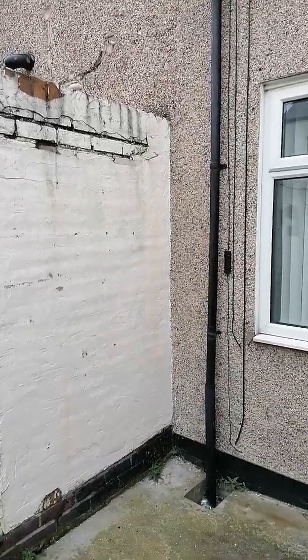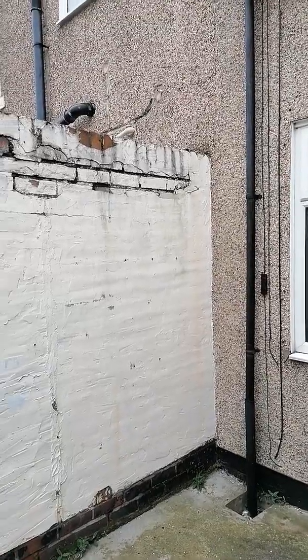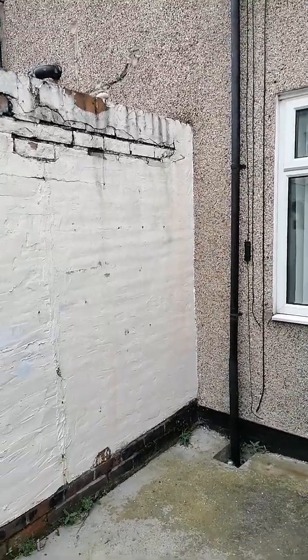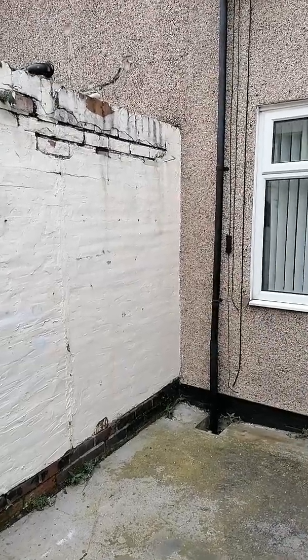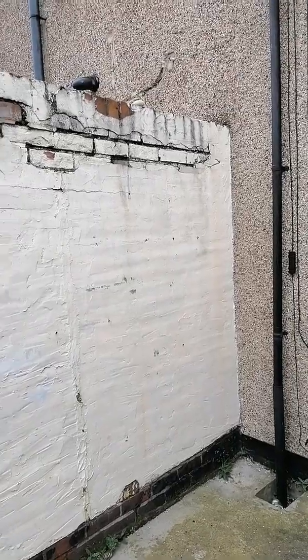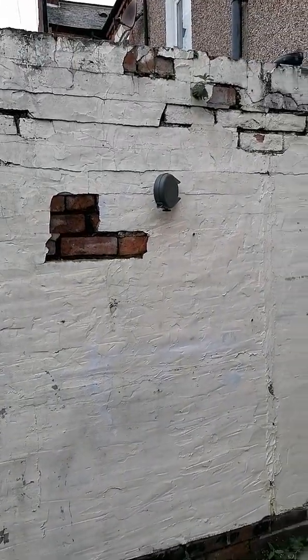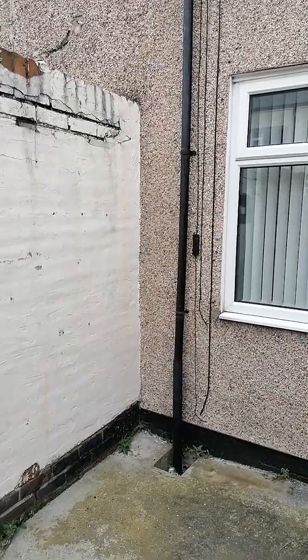Just a little tip: if you come across these distinct elevated readings — a lot higher than you'd expect — take a look outside. If you've got an abutting yard wall, it's almost certainly going to be a contributing factor, especially when it's rendered as in this instance. You can see the render isn't very good. I hope that makes sense — thanks, bye.